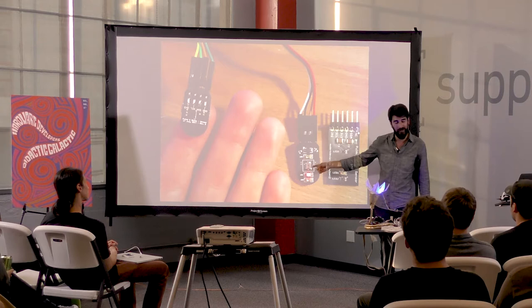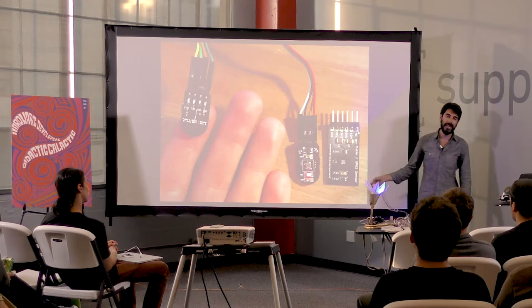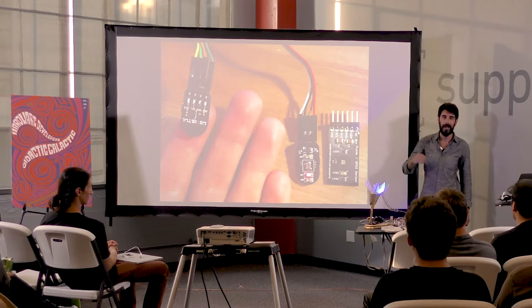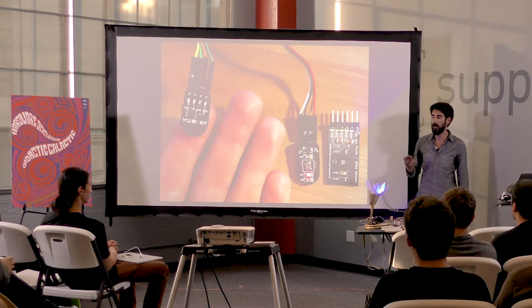The chip is a QFN package — a 10-pin QFN, four on each side plus two. It has three IR receivers: one visible light and two IR. Red is not the optimal color for pulse sensing; if you look at your Apple Watch or Pebble, it's green. IR receivers work better with green, but the project would have looked ugly with green light — no one wanted that. We wanted red. We're getting very little good data off the red, but the two IRs give us plenty, so it's good enough. The artist is happy because we get a better color.